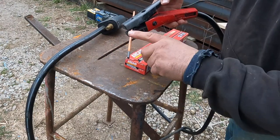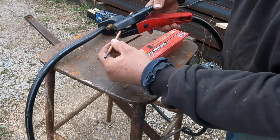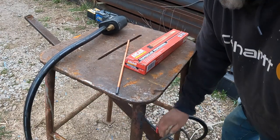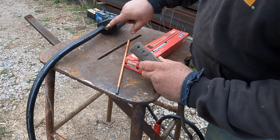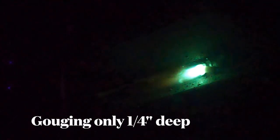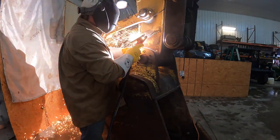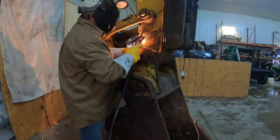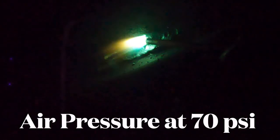If I want to spin this at any angle, I'll let that lever down some at the arm so it will move just a little bit. My connection is positive lead, constant current welding machine. I'm only going to dig a quarter of an inch deep — I'm not going to hang there and make a weld. I want to remove that metal quickly. I've set my air pressure at 70 psi.